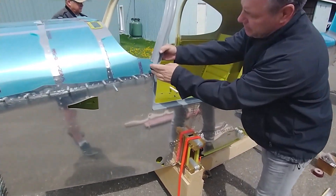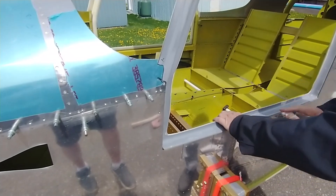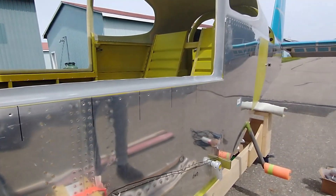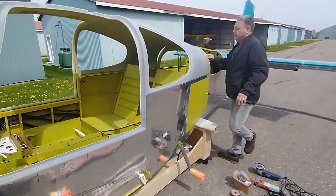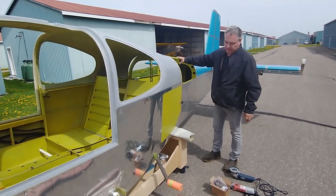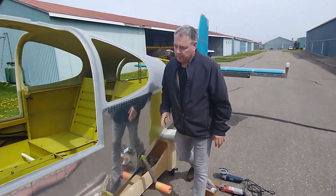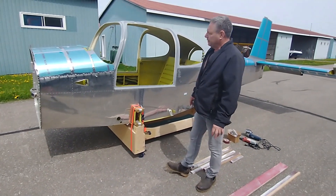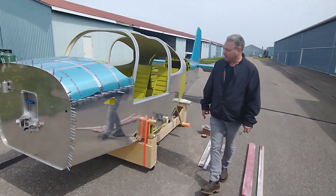Take a look here — you can get a good idea of how it's supposed to look in its raw form before it's fiberglassed into place. You can see it's a pretty tight fit all the way along, and again it gets bedded into adhesive or flox or whatever we're going to do. You can't put it into place with this section of the skin — it goes in after the cabin top is in place. We're almost at the point where it's going to be bolted down for good, and we can move forward with fiberglassing in the window and doing the door work, which is going to be an adventure.